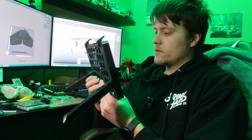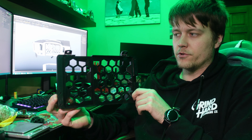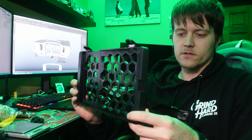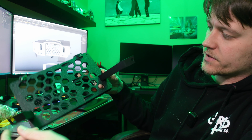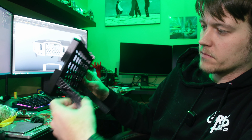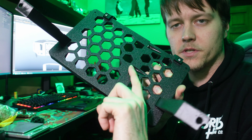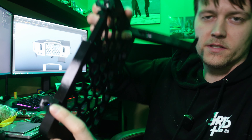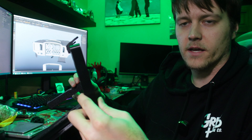The main part of this video is the new dash system with the new tablet. The core of the system starts with this new tablet holder. The brackets are slightly redesigned — mostly the same, just different mounting points — but all the pickup points for the dash are still exactly the same. I made new brackets that are smaller and simpler. This piece printed in two pieces, comes together with three screws, then the brackets attach with screws, and this whole piece sits inside the dash.